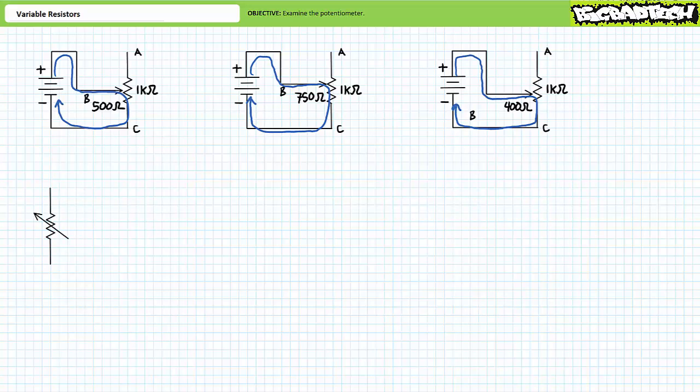Sometimes you'll see an ordinary two-terminal resistor schematic symbol with a slanting arrow indicating a variable resistor. You might also see a potentiometer wired with terminals A and B tied together with a zero-ohm wire. Visualizing the potentiometer as two series resistors, RAB and RBC, tying A and B together with a zero-ohm wire effectively shorts out RAB — any current will be routed around RAB. However, current must still travel through RBC, such that the potentiometer effectively yields a resistance equal to only RBC.